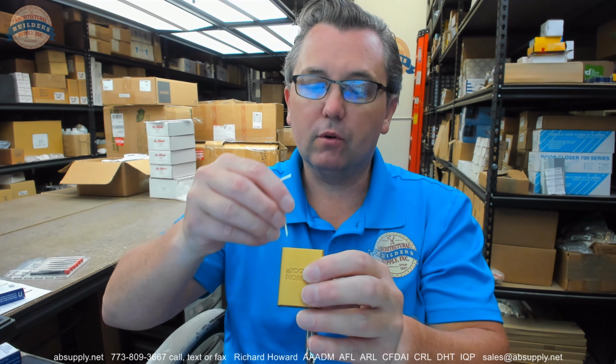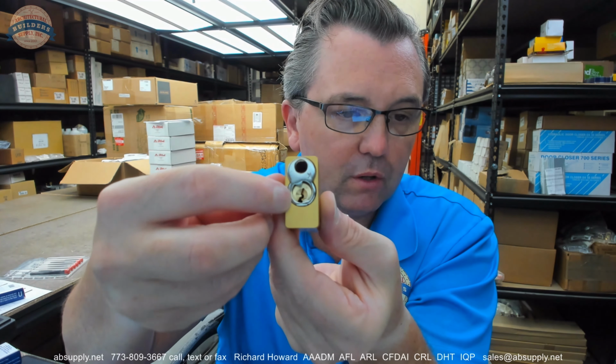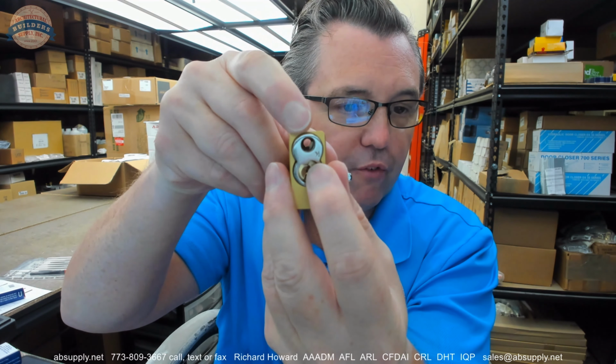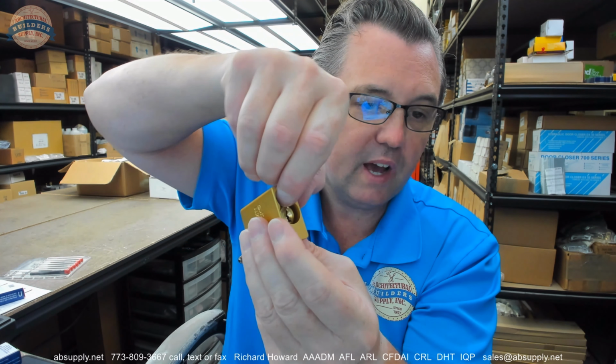It's going to have to turn over, lay over to one side. You'll see that the broaching in the plug is not vertical. That's because the Bible needs to lay over to its side, which you can see there, so that we can get the rivet back in there. It can't go together like that. It's got to be laid over on its side a little bit to get that rivet access there.